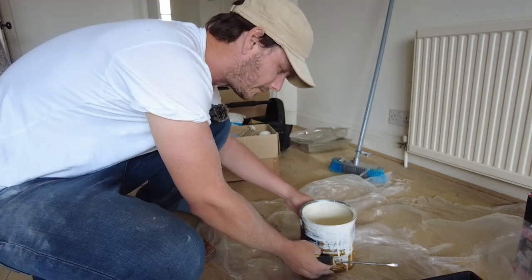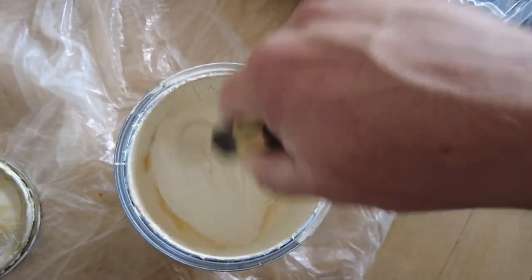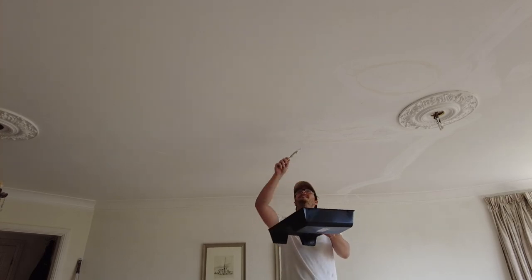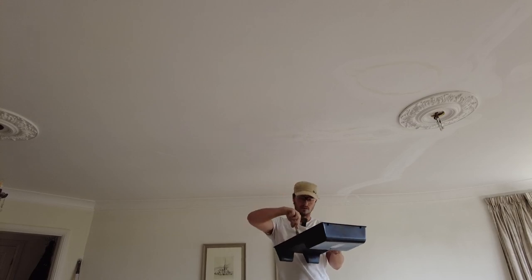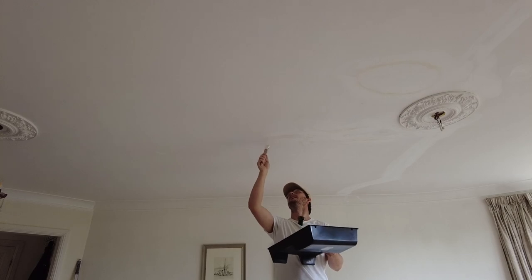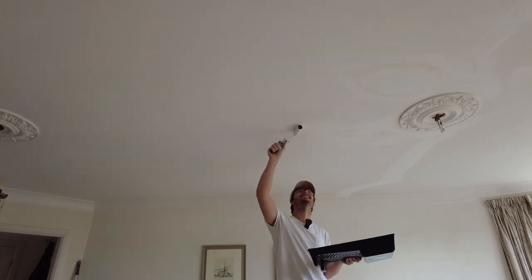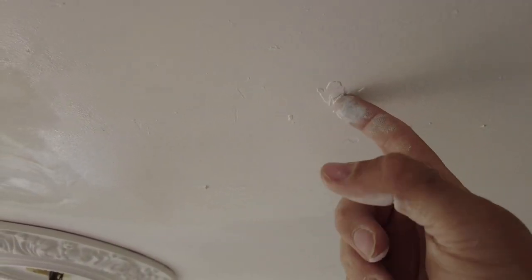Finished off my filling — I think that's pretty much good enough. The cover stain is oil based and I haven't used it for a while so I need to mix it up. This cover stain is good for wood or pretty much anything — tannins, sap, smoke stains as well. I should have got some paint strainers because there's loads of bits in it. I'll just roll it on — Jesus Christ, there's loads of them. It's come off there and stuck on there — it's peeling off loose paint. That was a disaster.